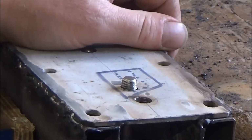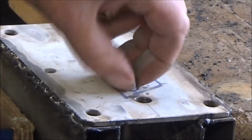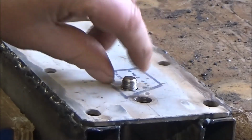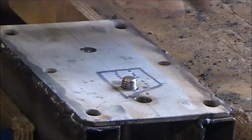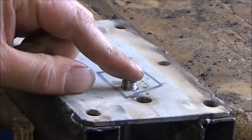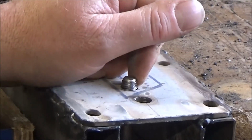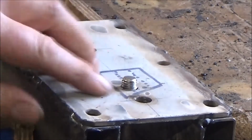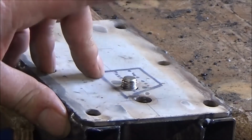Clark's. But I've hit a snag which I sort of half knew about, which was when you're welding somewhere where there's threads involved, there's a possibility it may actually weld the thread to itself, and that's what's happened here. It may just be a characteristic of the stainless steel bolts, just the same as I had with that U-bolt, where that got totally thread bound, both sides of the U-bolt. But where it's gone into the captive nut that I welded on, it is now virtually seized.